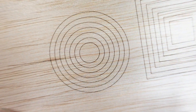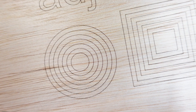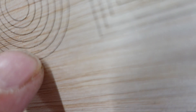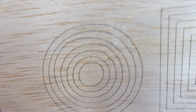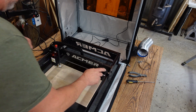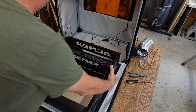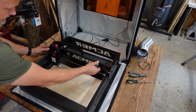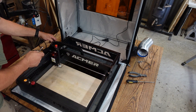So that's after our adjustment guys. My lines appear to be evenly spaced — it's really hard to discern where the line starts and stops. I still have just a touch right here at the very bottom where you can almost tell where the line starts and stops, so it wouldn't hurt to do a little more adjustment. But look over here guys — this is what we were working with. This is what that one eccentric nut out of adjustment looked like. I've got a wheel apparently on the back of this gantry on this side — one of the wheels is not contacting where it's supposed to, and I suspect that's what's causing that little variation that we still have.